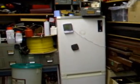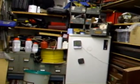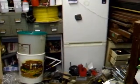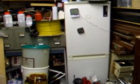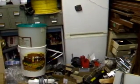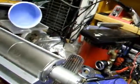So the fan will go at the top back, and hopefully if it detects the temperature's got too high, it'll start tumbling on and recirculate the air down, trying to cool the bottom. I suppose it might mean I end up trying to hack the radiator onto the same relay, so it all evens out, rather than using the basic analog thermal strip thermostat it's got in the radiator down the bottom. But excellent stuff. Now I can knock it up to 12 volts.